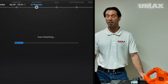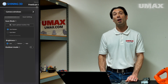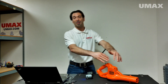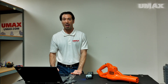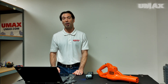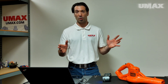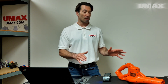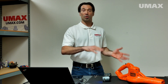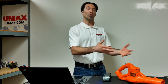We'll be selecting laser mode. I'm immediately offered the option of scanning markers so I can create a global marker file — I'm not going to do that, as that would be more for scanning a very large object. Since this is a smaller object covered in markers, there's no need for a global marker file. From here, I'll start scanning with my 13 parallel diagonally crossed lines — 26 lines in total — in multi-line global scanning mode. This is going to allow me to take in a whole lot of data all at once, and a little bit further down the road we'll switch over to some of the other available modes.